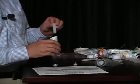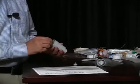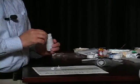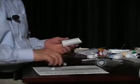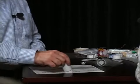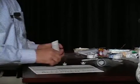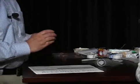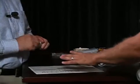If you fill this up, you'll probably have enough. So flow rate and time don't matter. Your goal is filling that up. It is possible to take it apart, look at how much you're filling it up, and put it back together. Your vacuum hose would go here, and you simply vacuum until it's full, then replace the plugs. There are no calibrations here whatsoever. You don't calibrate your sweeper.